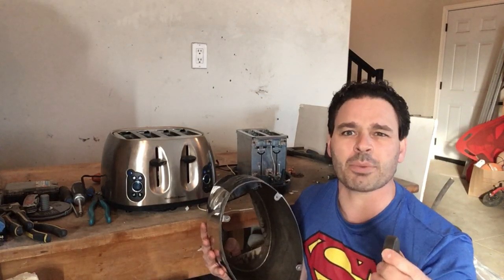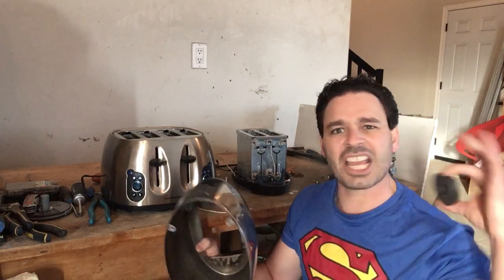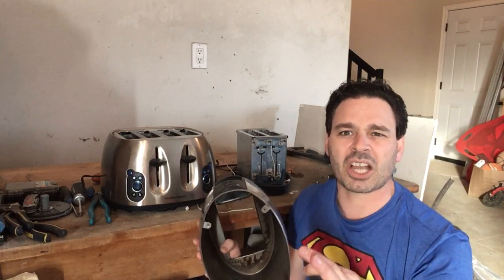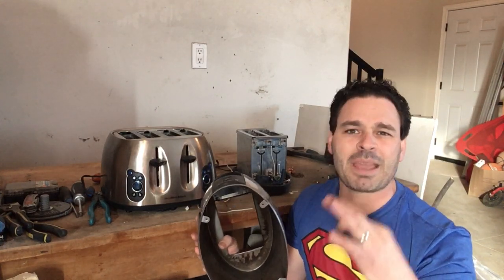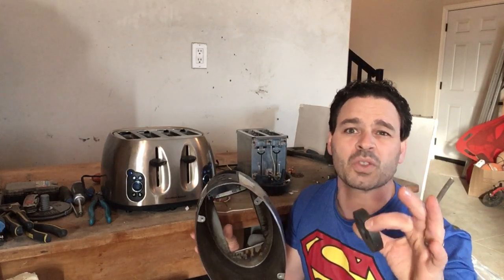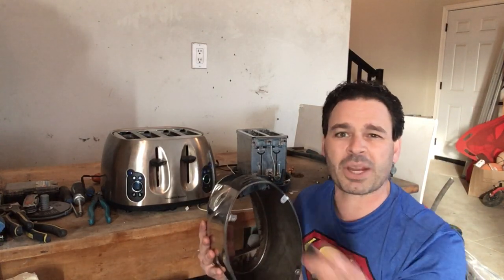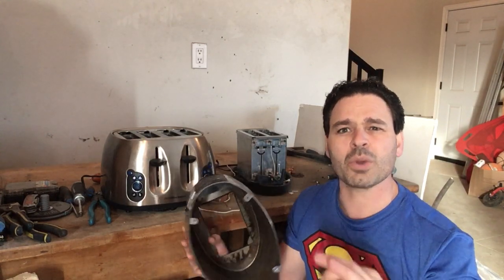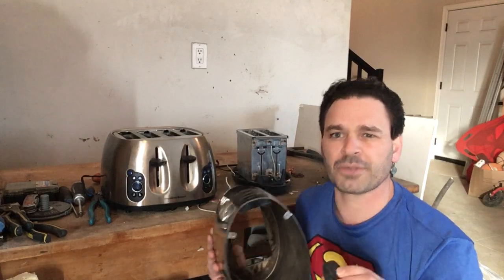Please do not just read the label and assume that it's stainless steel. If you have it in a mixed load, they are going to penalize you a lot on that — they may even give you just a dirty weight, which is actually going to be close to tin shred. If it is somewhat separate, they will hopefully be able to separate a little bit, but scrap yards do not have the time to separate it for you, so you do have to be careful of that.